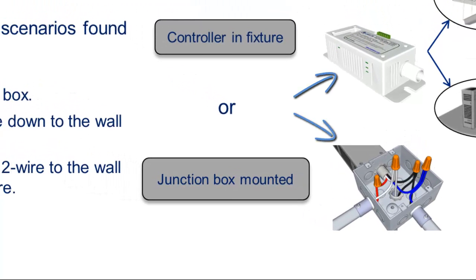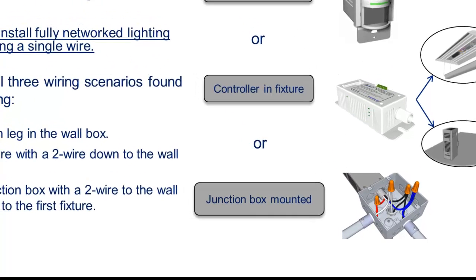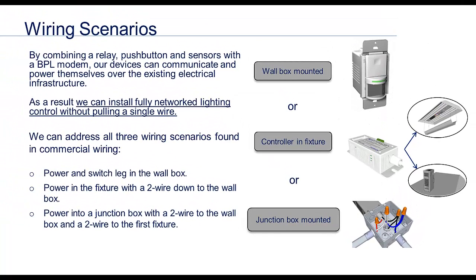In this case there's no neutral down the wall, so we can't use our wall mount device. We can still accomplish our goal by using the FM OC, also known as the FM. All that needs to be done is to remove a half inch KO from the junction box, run the FM in, spin on the lock nut and change the splice. Then go to the wall box location, change the light switch to a push button and you're done. The push button is a non-communicating device made by YWire called the MCS, which stands for momentary contact switch.